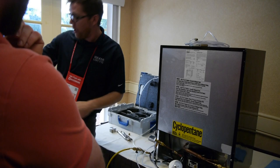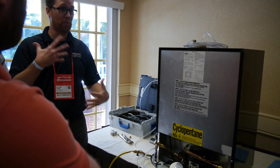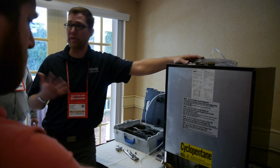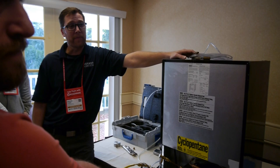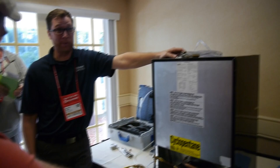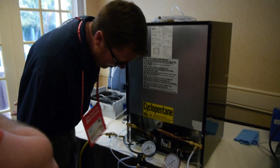A lot of this is based on your experience. Knowing, for example, that this compressor was cold — maybe it was out in someone's garage and it couldn't run. That's why I ran this system so long: I wanted it to be running, get the oil nice and warm, and make sure everything was where it needed to be. You could use hot water and towels to warm it up if needed — just be mindful of customer property like hardwood floors.